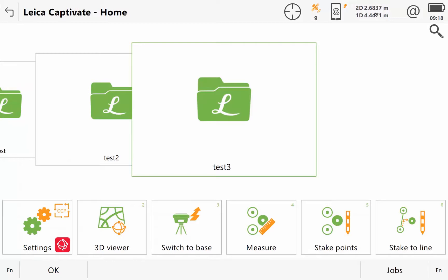You can see we've got an accuracy estimate, and this is fairly high in uncertainty. A way to get more accurate position measurements is to essentially occupy a point for a longer time to get more readings — that could be 30 seconds, a minute, or several hours. Another way to get better accuracy is to talk to another GNSS receiver tracking the same satellites, so that between the two of you, you can cancel out a lot of the ambiguity or interference introduced by the atmosphere.